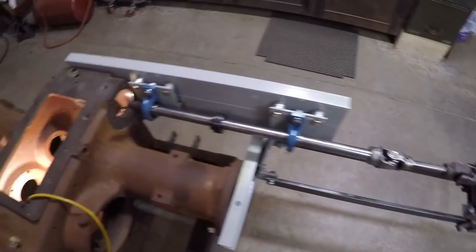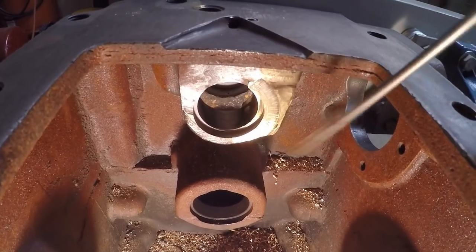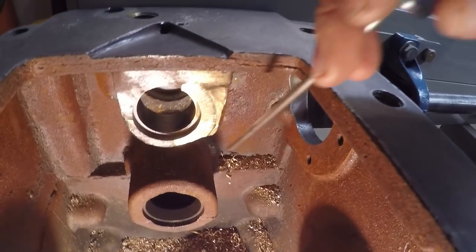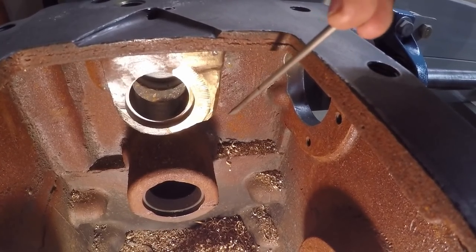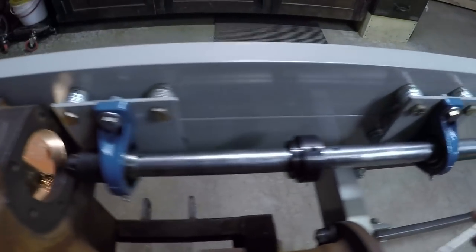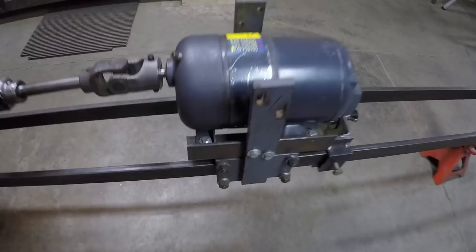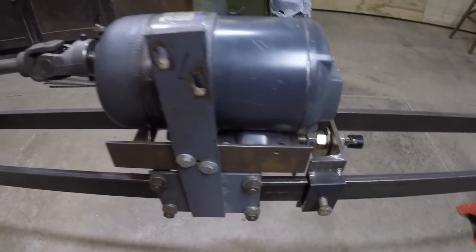The work that I've done so far with this setup has consisted only of resizing open-ended bores, and it's worked very well for that. The problem I'm having now is that I'm set up to do face cuts on this part of the casting right here. When I'm in an interrupted cut and the cutter bit comes around and contacts the material up here, it actually causes the entire bar to pop back and then lunge back forward a little bit. I believe the problem lies within my drive motor track system and feedworks assembly.